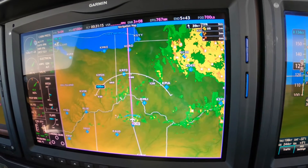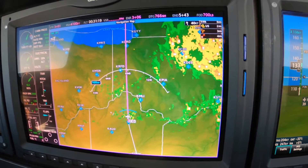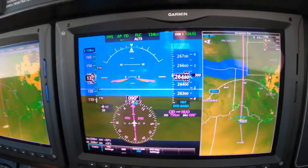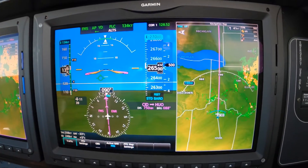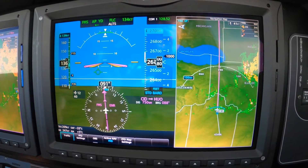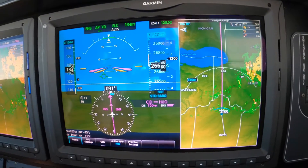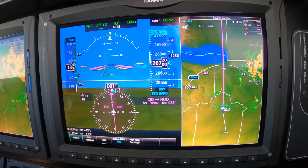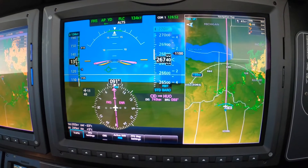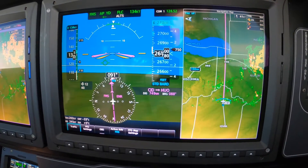So we scaled the temperature back. As some of you may know, in a turbine, up high you're going to be temperature limited, down low you're going to be airspeed limited. Of course, here in this M600, we're at a VMO of 250 knots, so it's a much more capable airplane down low.